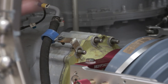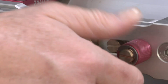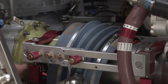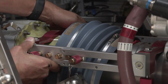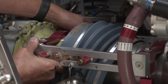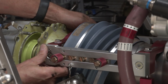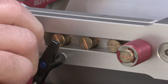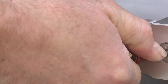Once all the sealant and hardware is removed, we can loosen the four knurl nuts on the tool. Ensure that the two ball pins are removed from the outer clevis and slide the main rotor gearbox torque tube and gimbal ring contained within the outer clevis aft towards the engine. Now insert the two ball pins and tighten the four knurl nuts to keep the tool properly positioned.